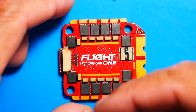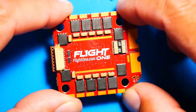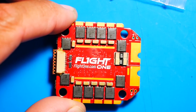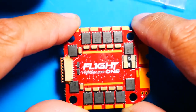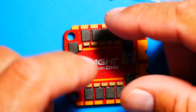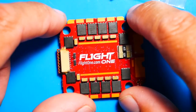The second reason they left this gap is for freestyle pilots. As a freestyle pilot, you've got no business with a big heat sink because you're not pushing your quad that hard. What you want is extra capacitors — all the filtering you can get, the cleanest video, the smoothest most locked-in feel. They're going to offer an actual plate that goes on top with all the extra capacitors you can ask for. You'll still add an external one too, which will really help.